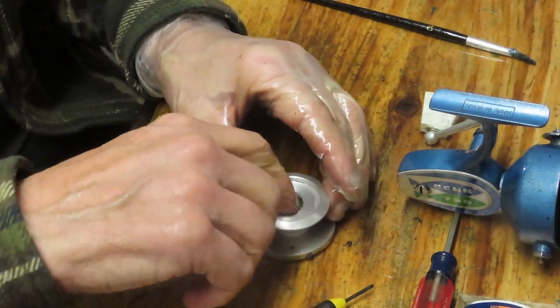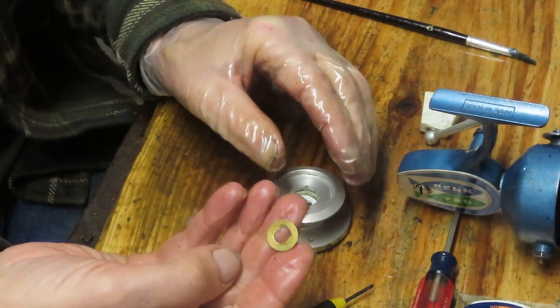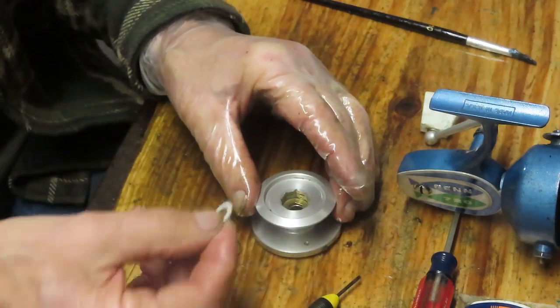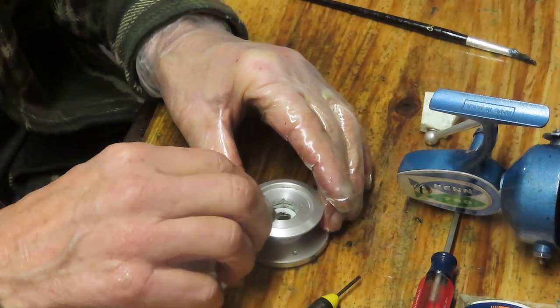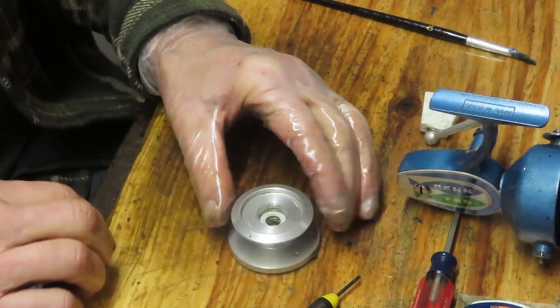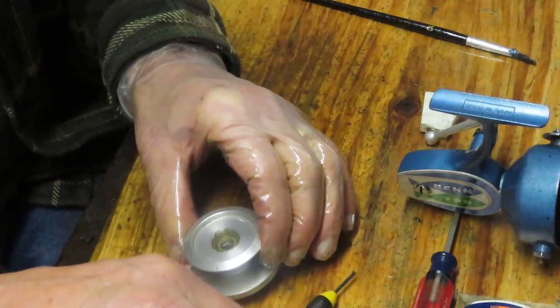You start with the plastic washer. You're going to find 2 round washers that have relatively rectangular internals to it. Those are called keyed washers. They go top and bottom. Second of the Teflon washers. This is the one in the middle now. It's a hex. That's going to hold the spool to the shaft. Last of the plastics, last of the keyed washers.